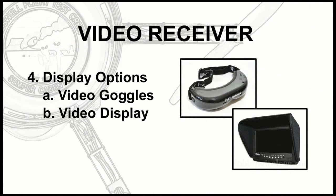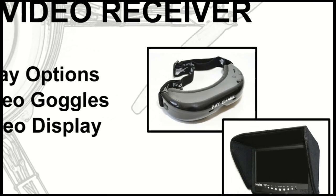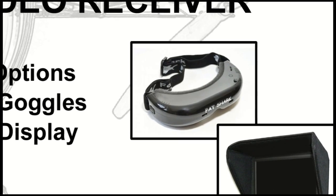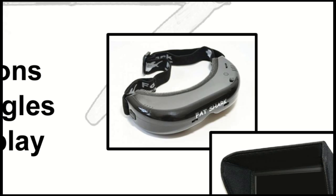Next up is, obviously, you've got to see your video on the ground. And here we've got two main options, which are video goggles or a video display, basically a small television set. The main thing about the video goggles is they're very immersive. Your world disappears, you're in the craft. Personally, I find it's easier to fly because you're not looking at the craft and losing your orientation constantly. Bad thing is it causes vertigo in some people. If you can't play video games for too long, you won't like this.